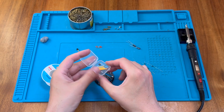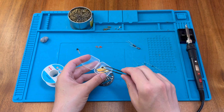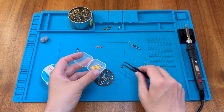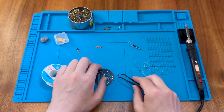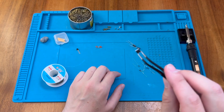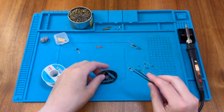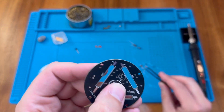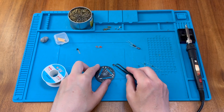We'll need this little chip — this is the touch chip. There should be a pin one marking on this chip, and there is a little dimple just in the lower corner here. That aligns with the dot indicator on the board, so the chip goes around this way.